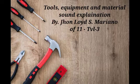their importance. 1. A single pole switch has one input and output. It has two states, on or off. They can be wired either normally open or normally closed and can be either latching or momentary. There are two types of single pole switch. These are single pole single throw and single pole double throw.